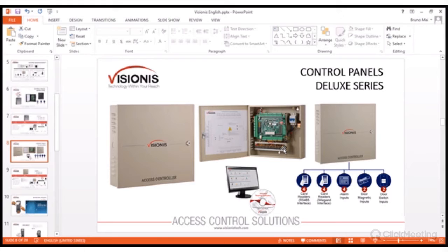You're going to have a fire alarm interface with a positive and a negative. All you have to do is connect your fire alarm relay cable to there. Any fire alarm company, it's their obligation to give you that cable to connect it there, so you shouldn't have to do that. They just give you those cables, you connect it there to your access control, and you should be set.